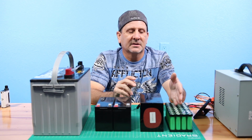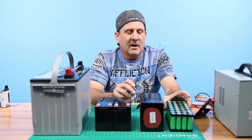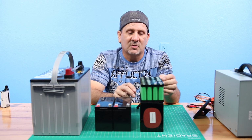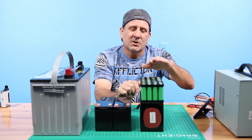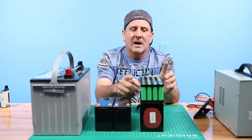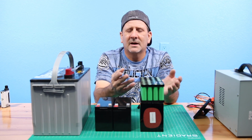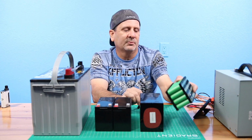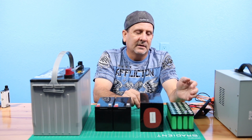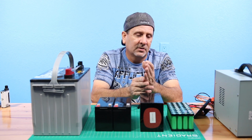And rather than just running a 12.8 on these batteries with 3 cells, actually 12.6, you don't have a lot of room when you start discharging. And so I'm going to run a 4th cell and bring it up to 16.8 volts, and that'll pretty much run all 12 volt inverters, and it'll just give you more power and more longevity on the devices that I'm going to be providing you.